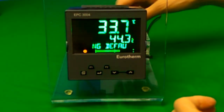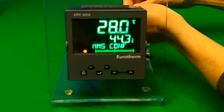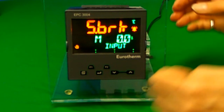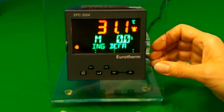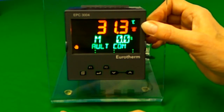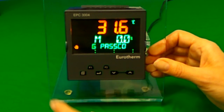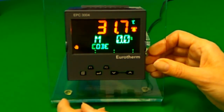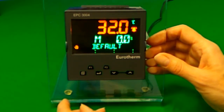If a fault happens, such as an open circuit, the screen will show the alarm with an alarm bell in the top right hand corner. The process value will be shown in red. Forced manual is selected, shown by the hand symbol. The PV will be in red if it is still in alarm or if it is not yet acknowledged.